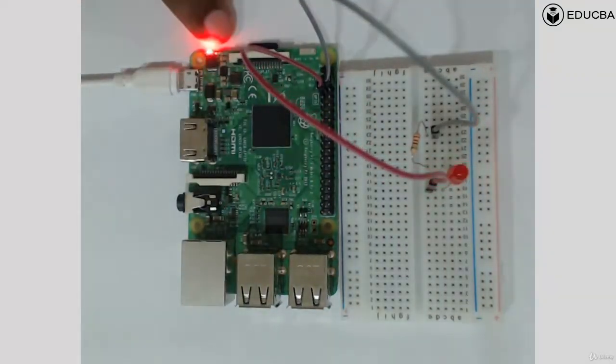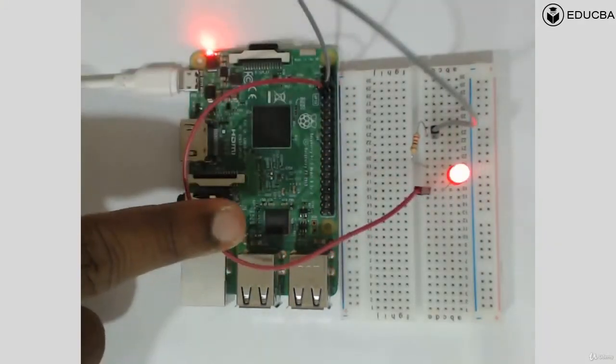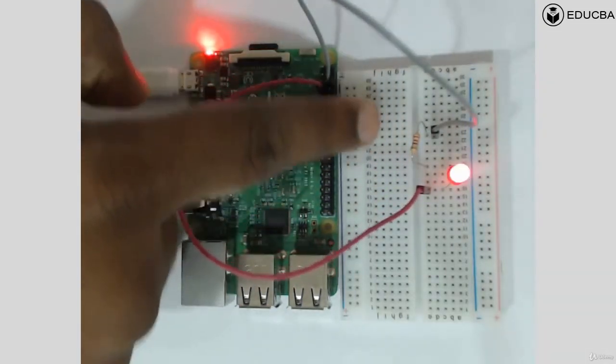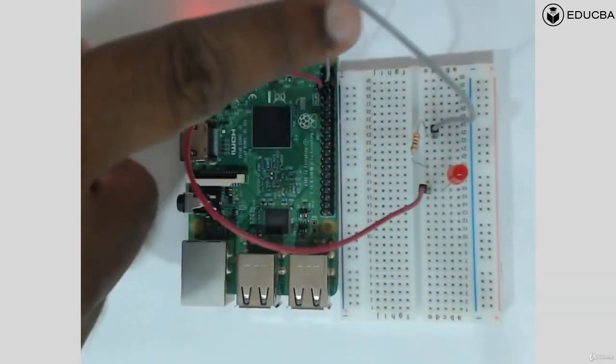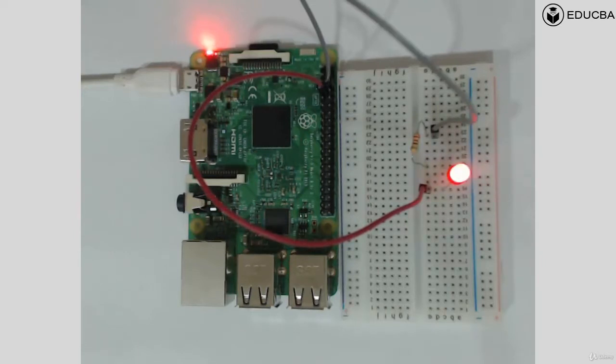Since you've already programmed pin number 7 for blinking every 0.5 seconds, there you have the output for blinking. So you have the anode connected to pin number 7, and then you have the cathode via the resistance. After the resistance, that particular wire is then connected to the pin that is ground. All right. So with this, of course, we have finished the blinking program.